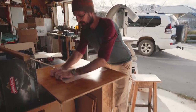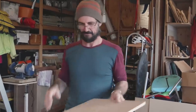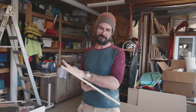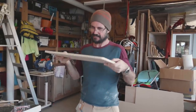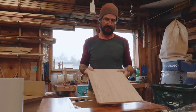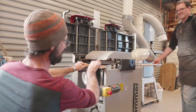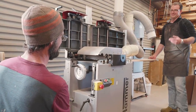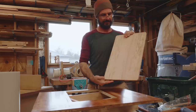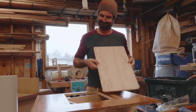This is just slightly proud — this plywood is ever so slightly cupped. Because it's not exactly flat, it sort of doesn't sit exactly in our recess even though we made it exactly the right size and depth. So Lance just suggested he had some laminated Tassie oak that wasn't required and had a couple of issues. He's got a really great thicknesser there — we ran it through the thicknesser and this is the end result: a nice flat, pretty stable laminated bit of Tassie oak. Pasci chose this bit because it's got some interesting grain, so we'll be able to remember our time in Tassie each time we look at our table.